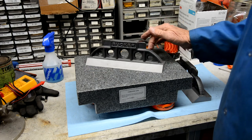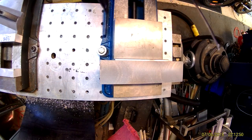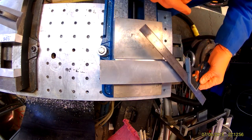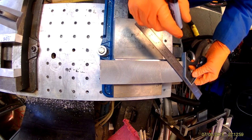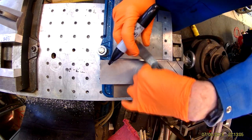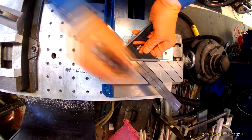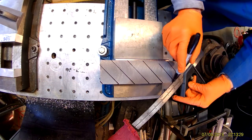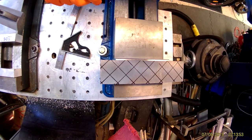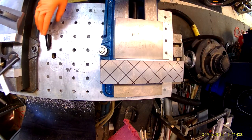That's horrible right now as far as high points. One thing that can be done to help you get your scrapes in the proper lines is to go ahead and draw some 45-degree lines. When you've done enough scraping, you don't need to put these lines on — you kind of know which direction to go.